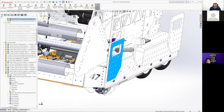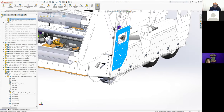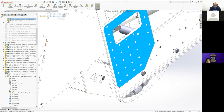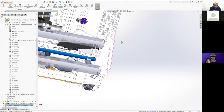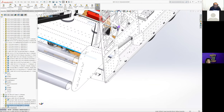The reason we do our drivetrain this way, with this bottom flange bent out, is so we can rivet in these Lexan side plates and mount to the very edge of our robot. So this lets us put a bar spanning the entire width of our robot that acts as our intake pivot. That bar also supports this plate so it doesn't drop. So that kind of sets our height.